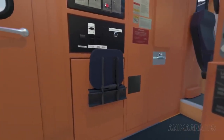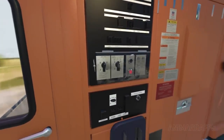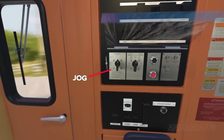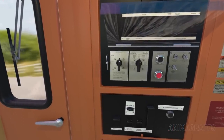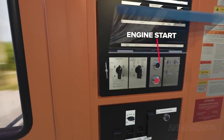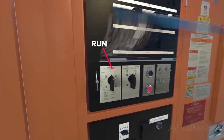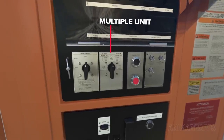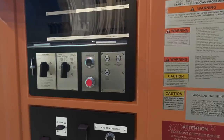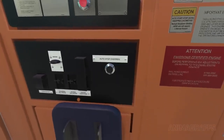Moving to the back wall, there's an additional fold-out seat, and above that a grouping of circuit breaker modules and switches. In the middle there's a protected engine control panel. The jog setting allows movement under battery power alone without starting the engine, used for short distances like moving in or out of a repair shop. With start selected, the engine start button initiates the engine start sequence. Isolate leaves the engine running at idle but disconnects the main generator and power to the wheels. The run setting is for normal operation. The multiple unit switch has settings for linking multiple locomotives together in various configurations. The last panel controls crosswalk or ditch lights, number sign lights, and lighting for other control areas. The auto stop override button prevents the engine from shutting down automatically for two hours.